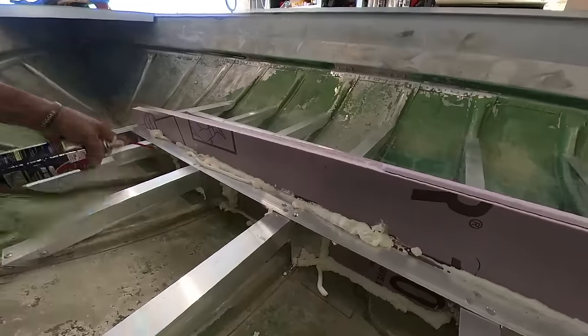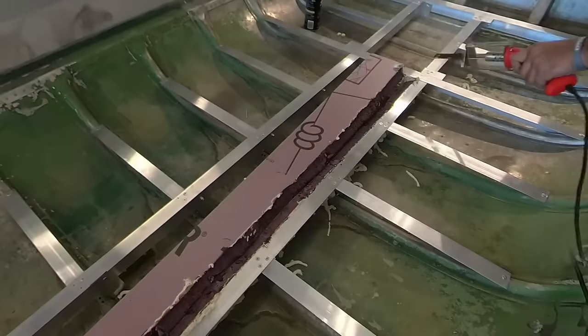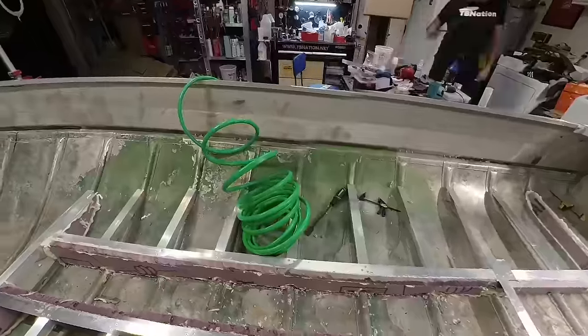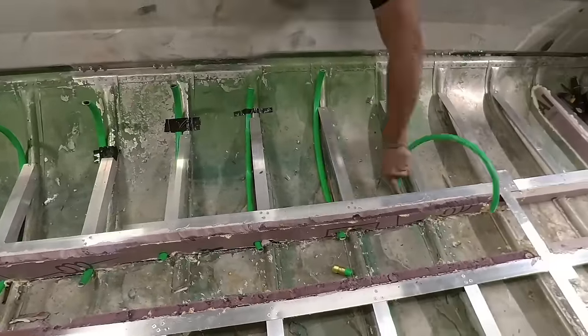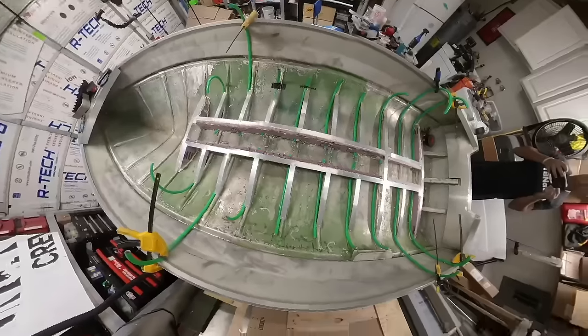We got questions for years on end of how you get around with boats that were designed like this, with these ribs that would not drain out water. The only option that we have truly is to make a higher floor and one with a nice middle channel that will just channel the majority of the water directly down that area.